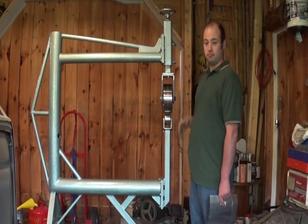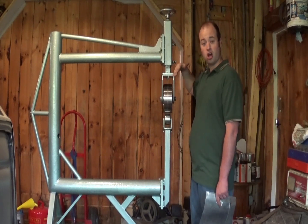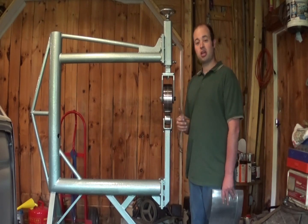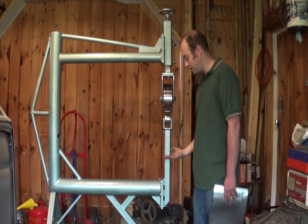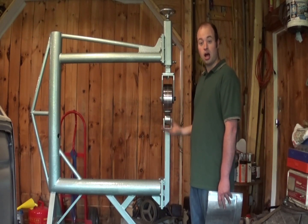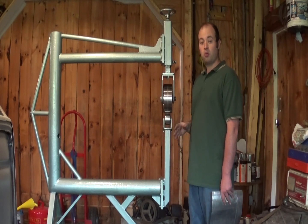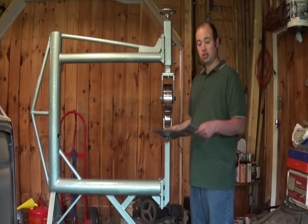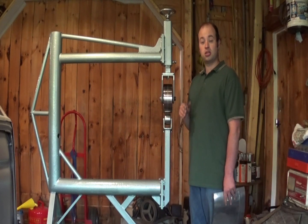This is an upper adjuster. It's named an upper adjuster because it adjusts the top wheel up and down and it has a hand wheel up at the top. The other style you'll see are lower adjusters, which have the wheel on the bottom and they adjust the lower die — which is what they usually refer to the lower wheel as — up and down. The benefit of the lower adjuster is if you make a wheel that has little spokes to it, you can actually kick it while you're working the panel and adjust the pressure of the rollers on the fly.